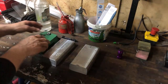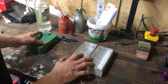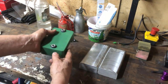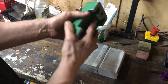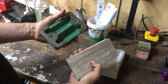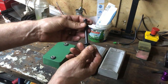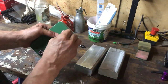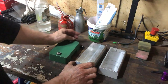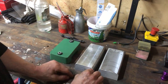And here they are, together with one original. I made them a little bit lower, suited to my application here. The originals are a little bit higher. As you can see, this is cast — it's hollowed out. I'm lazy, so I didn't need more than that shallow relief anyway. These are now drilled and tapped for these screws, and there are rubber gaskets with liners, so to speak. I intend to make something similar following the bolt pattern, with bolts going down to the casting here — and of course adjustable.